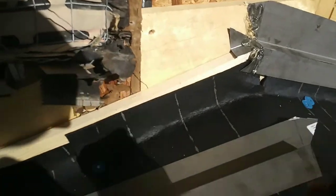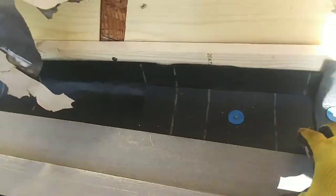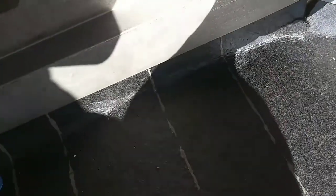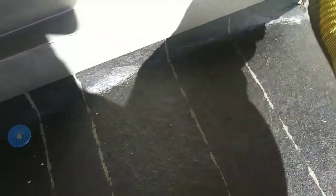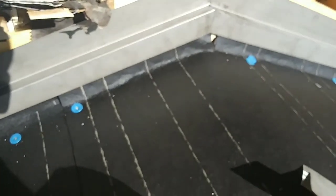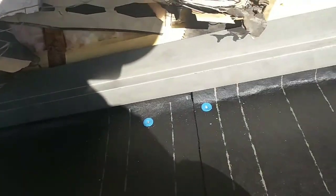As you can see, I put a lot of caulking right there where the other piece is gonna interlock with the piece on the bottom over there. I didn't put any caulking here because it's on an angle, so it doesn't really matter. Because the slope is going down, the water is gonna slide down. But right here it needs it. You see when I push it, the silicone comes out. So clean it out. Go like this, okay? And that's it. I'm just gonna tuck my metals underneath the Z-bar when I come back. It's ready for the stucco guys.